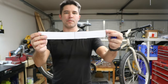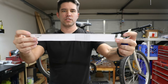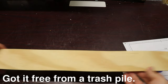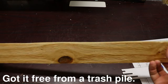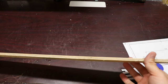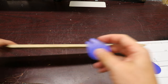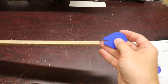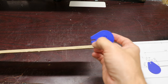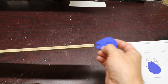I did create this paper full-scale size template which we're going to use to make the real one. I have this piece of quarter-inch plywood that I think will work perfectly for this project. It's a little thicker than I wanted — it's quarter inch whereas the cutouts it needs to connect with are only three millimeters. So luckily I printed those out solid so I can file them open a little bit to make them fit.